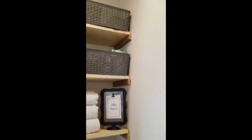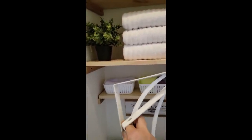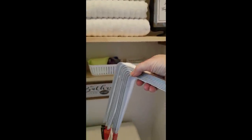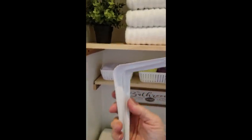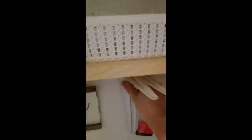This is a unique setup in that it has a little closet effect, and this is the most common shelving I do in closets. But if you have an open wall, you can absolutely use these types of brackets. These were from Home Depot and they're about five dollars a piece — they're a little bit prettier. But if you have a 99-cent store near you, they sell these brackets as two-packs for 99 cents and they're just as strong. They have a groove in them to strengthen the steel. They come four inches on one side and six inches on the other, so depending on your shelf type, if you're using a smaller six-inch shelf you could simply mount it underneath like that.